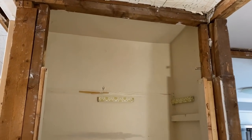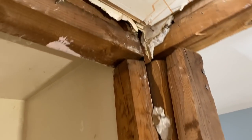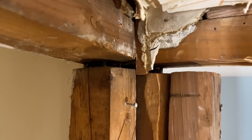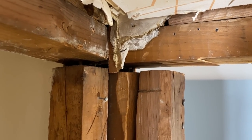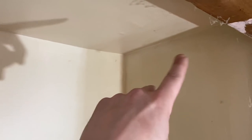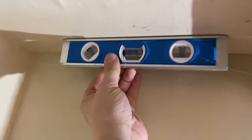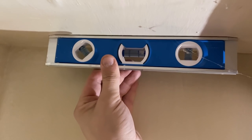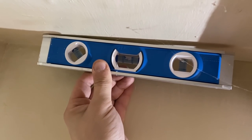After opening that up, I have yet another indication that all this is sinking. I don't believe the ceiling is sinking, but you can tell the floor definitely is. You can't see any cracking in the drywall, which would be a very good indicator that it's sinking, but that must mean all of the framing is sinking together.